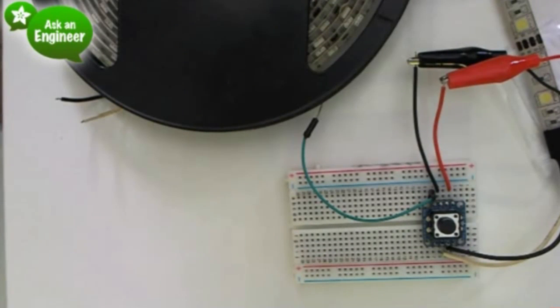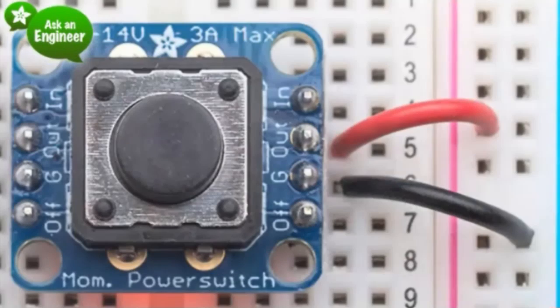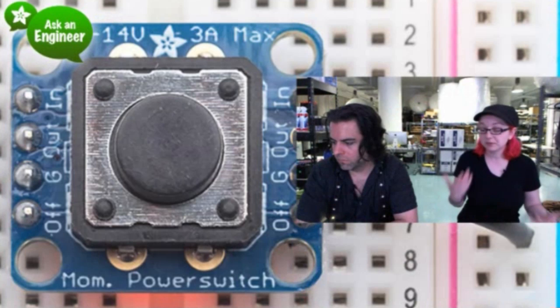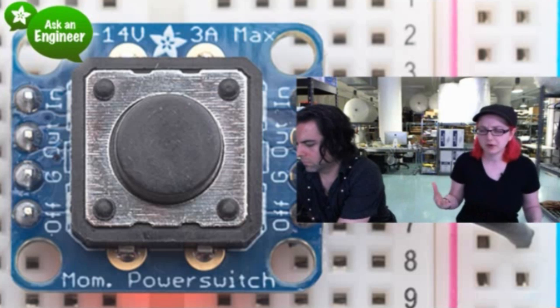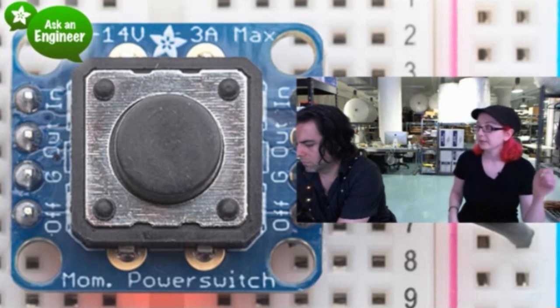So it's kind of an easy way to add a pretty intense power controlling switch to a project, if you want an elegant push button or you want it to be on your breadboard. It's nice and small and kind of handy. I like the kill switch because for some projects that you want to turn itself off, it has that ability. And it's all analog, so it's pretty simple. And it doesn't use a lot of current, so the quiescent current is like 0.5 microamps, maybe even less. This is the max. According to the data sheet, the max is 0.5 microamps. So you can use this for a battery-powered project.